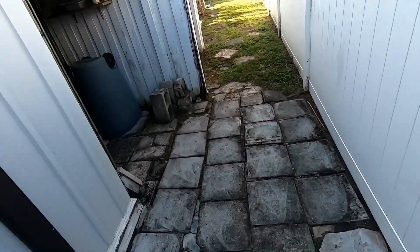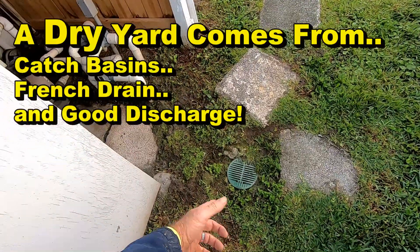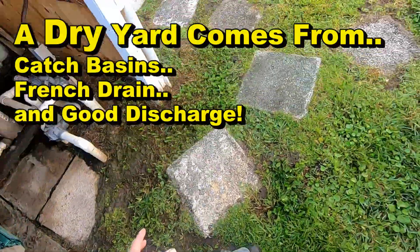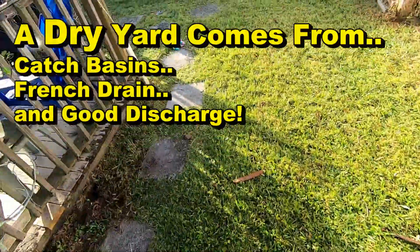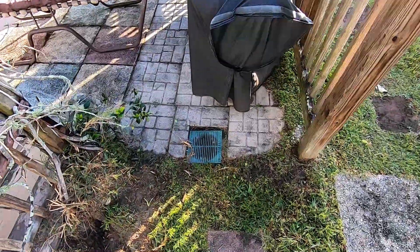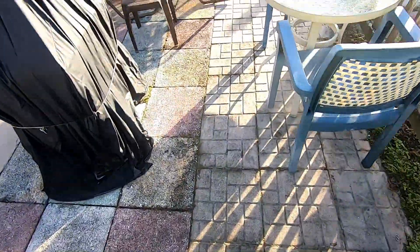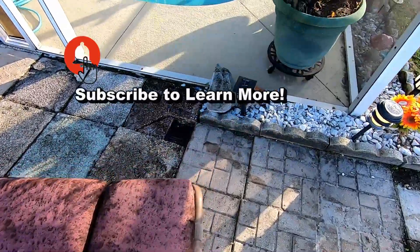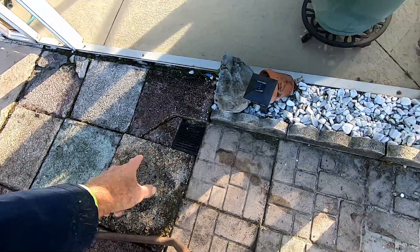This is a great example of how a French drain with catch basins should be installed. You can see beginning here at this catch basin — notice it's just a little six by six, my favorite catch basin. We add catch basins to the low spots of the yard and then we add French drain. Remember, this yard was totally underwater. For the French drain here, we like to use easy flow, which is perforated pipe surrounded with styrofoam peanuts, and it does not float out of the ground especially when it's buried down a foot or more deep.